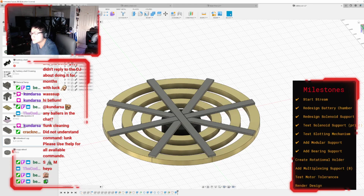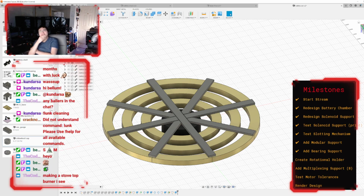make a disc that screws this whole thing in. Let's see, what kind of screws do I need for this, actually? This slab is 10 millimeters thick, which means with the offset for the counter bore holes, it's gonna be 8 millimeters of depth, and then it has to go at least 8 more millimeters deep to hold it in place. Do I use 12s? Is 4 millimeters enough, or do I use 20s, or do I use 16s, which I don't have? Ooh, that's the real question here. What kind of screws do I use for this?